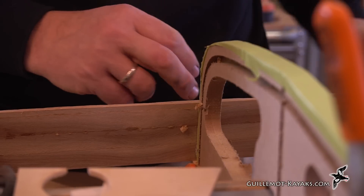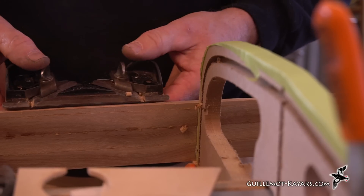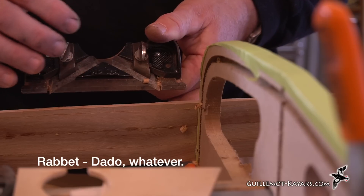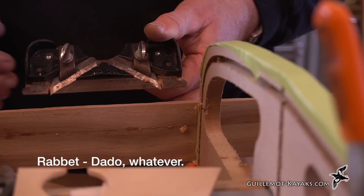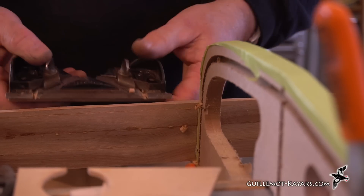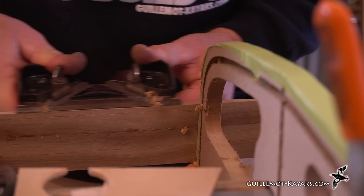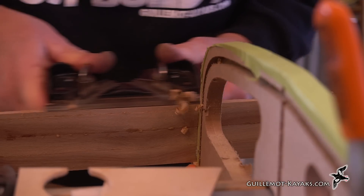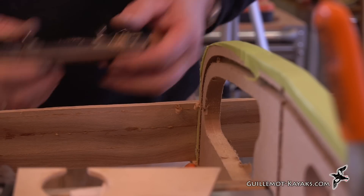These little shoulder planes are designed to trim along the edge of something — basically designed for making rabbets wider. A rabbet is a slot in the wood. If you're fitting a shelf and the material doesn't fit into the slot, you can use a side rabbet plane to widen that slot. In our case, I have a fence here that helps me move right past that form without slowing down. The presence of the form doesn't affect my work — I continue to go all the way down the length without worrying about where the forms are.